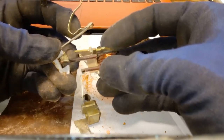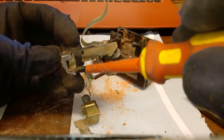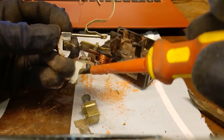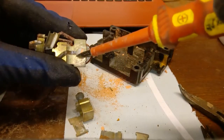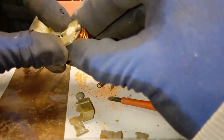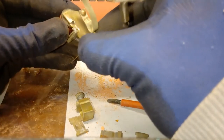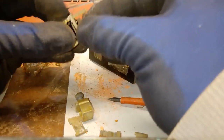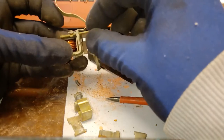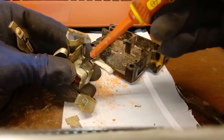There you have the top with the spring, the bimetal — I might keep the bimetal for something — and the electromagnet, which is a legitimate coil. Again, I'm shocked by how thin everything is here. That's the output electrode and the bottom of the magnet. I'll try to remove the magnet — all I need to do is remove this bridge, and that requires removing the spring keeping the bridge up. There we go — good old Czechoslovakian communist technology. Relatively easy to disassemble.